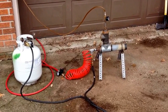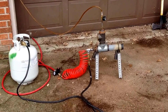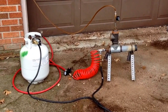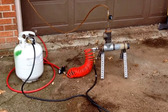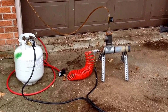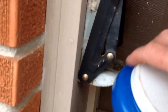This is my waste vegetable oil burner, made out of standard pipe fittings. There's a siphon nozzle in there — the nozzle is set for one gallon an hour. I've got a propane bottle hooked up to it. We can start it on propane, and once the oil gets burning good we can shut the propane off and it'll continue to burn on oil. I've got my air intake for the siphon nozzle to siphon the oil in, and right now I've just got a funnel up here with used vegetable oil in it — filtered, nothing else done to it.